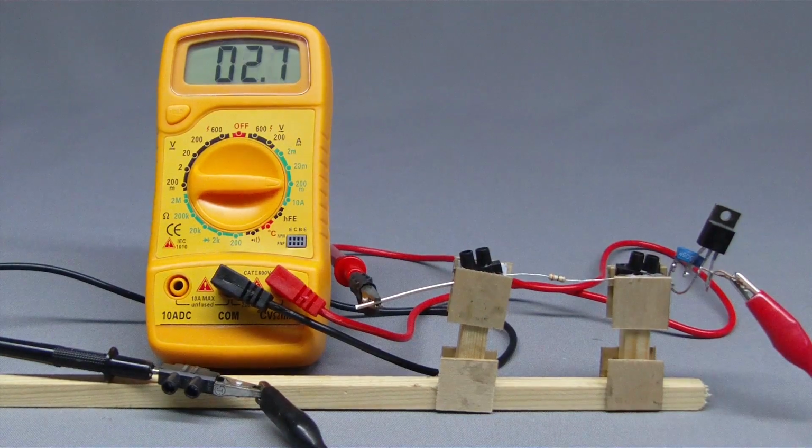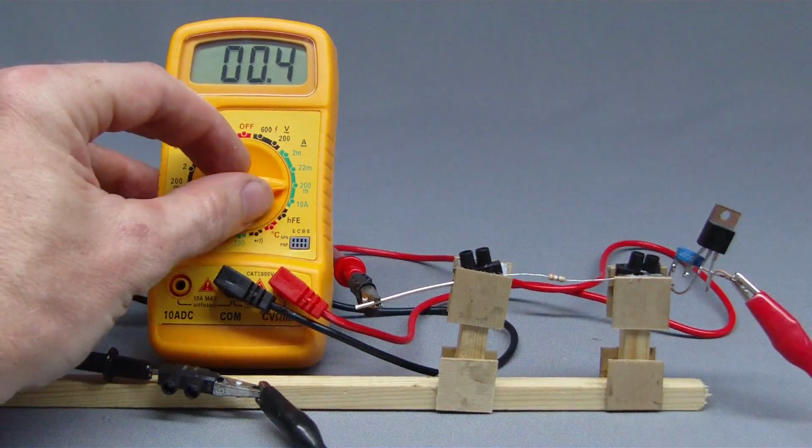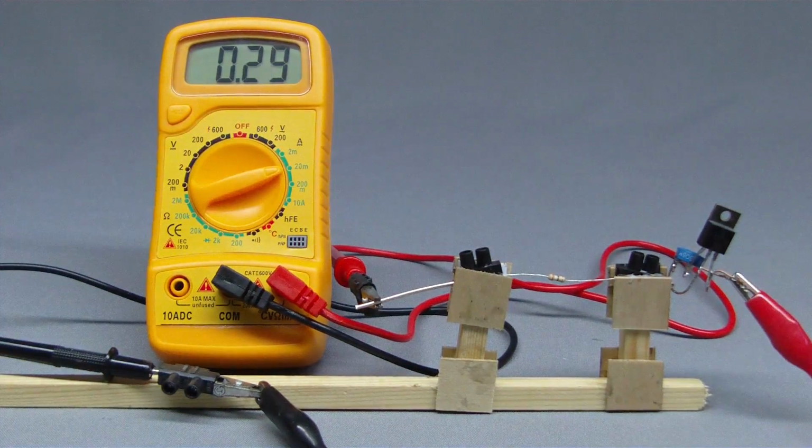When doing current measurements, the power supply should be turned off while switching to another range. The current running through the multimeter is interrupted for a short span of time whenever the switch is turned to another range, which may cause dangerous voltage peaks if inductors are inside of the test circuit. The lower range allows a more precise measurement and a value of 4.52 mA can be read.